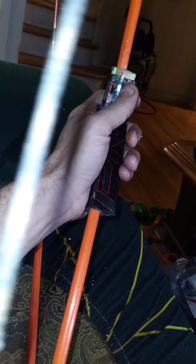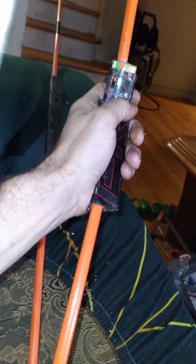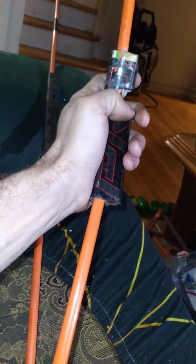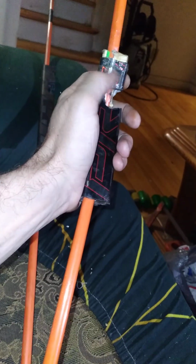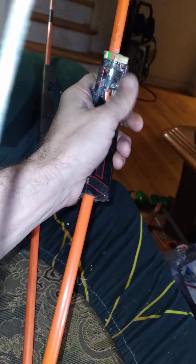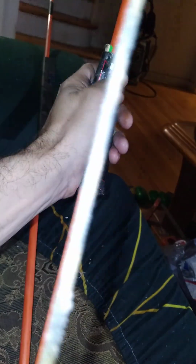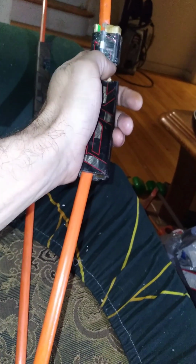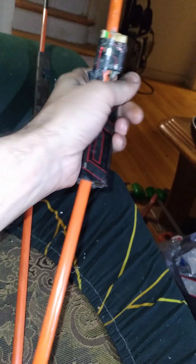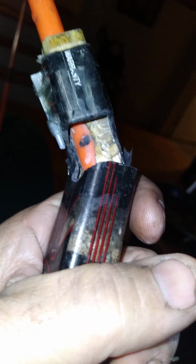So what you need to do is put it together, shape it, and then put it all together, soak it with hardened epoxy, and then dial it in from there and sand it if you have to, and re-soak the edge to re-harden it, and you'll be just fine. That way, anywhere you sand, you're not leaving a weakened section of wood or exposing a fresh surface. You want to coat it all and make sure it's nice and coated evenly. And you'll find that it's much, much tougher, guys. Much, much more reliable. In fact, wood can be damn near bulletproof if you soak it with the right materials, guys. Keep that.